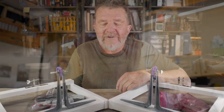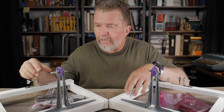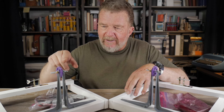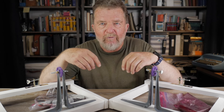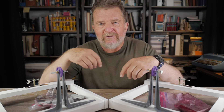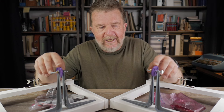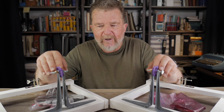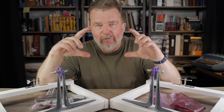I'm surprised, but it looks like it actually works. So I'm going to put together the second unit and have them both ready for our workshop this coming Sunday. As I was reviewing the footage of me testing how the whole system worked with a reel of ribbon on it, I noticed that because the mounting bolt was sitting in the top of the hole — the center hole of the Bako reel — the reel was rotating eccentrically, causing a kind of jerking motion to the winding. So I decided: hey, I have a 3D printer. Let's 3D print some little center hubs for these spools so it'll spin closer to the middle of the reel and be a little bit smoother.